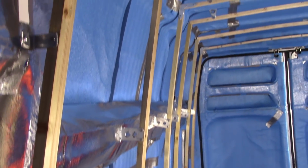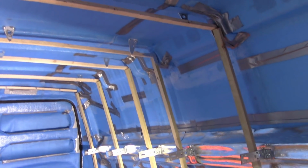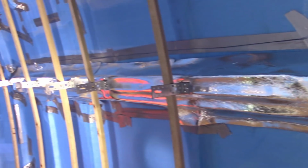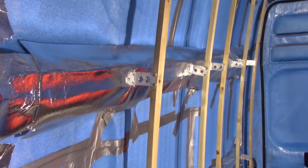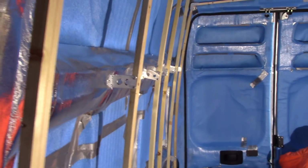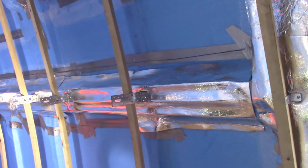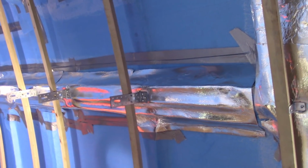As you can see, we have now got all the verticals and horizontals up for the cladding. All the ones that are going to be the same anyway. And see the brackets at the top here. All worked very nicely. Went in quite quickly, and the shop bought steel brackets on the side for attaching our furniture, and then on the side that's going to be without furniture, the homemade aluminium brackets. I'm regretting not making aluminium brackets up on this side. Don't know why, just because, I suppose.